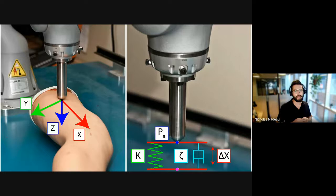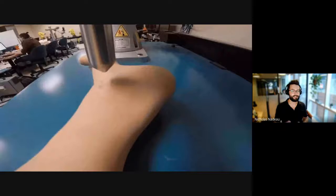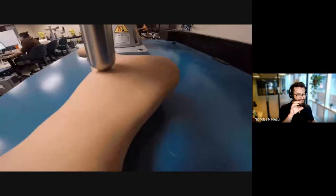And so every body part or object has its own stiffness in its own way and properties that would need its own controller tuning. I don't want to create a controller for necessarily every type of region of body, for every surface and contact situation. So I thought, this is an unstructured environment. How does the robot even know what it's in contact with? And can I train models and use learning approaches to tell the difference between, let's say, a leg and a table, or just a table by touch? How about the difference between a calf, knee, and ankle in different body regions?